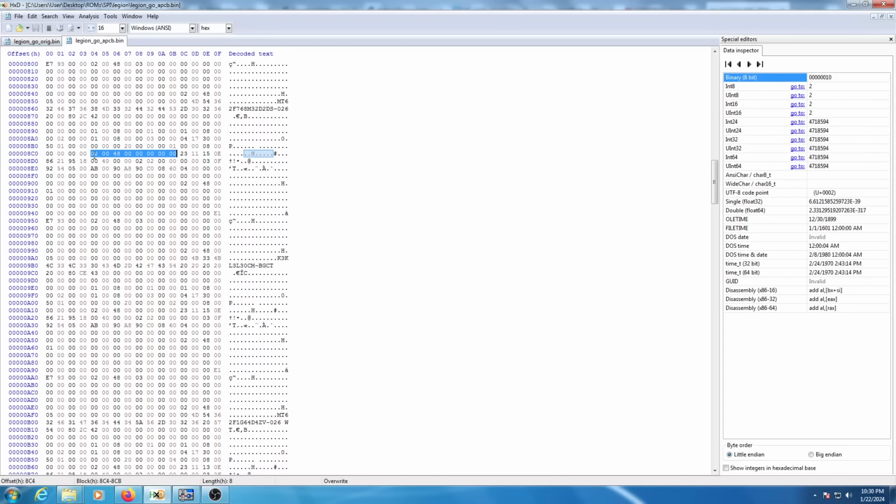There's the beginning of the data. Now this piece of data is just a header, but the actual SPD data starts here. According to that SPD specification document, byte 0 is this 23 here, byte 1, 2, 3, and so on. So we want to go to byte 6: 0, 1, 2, 3, 4, 5, 6. And you can see that byte is 95.